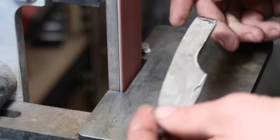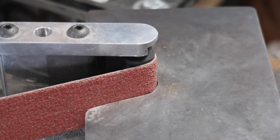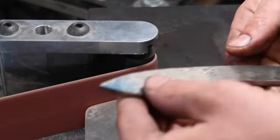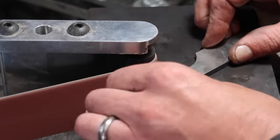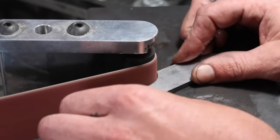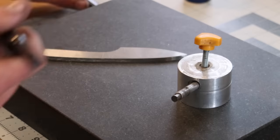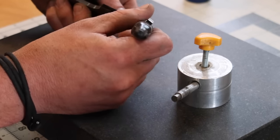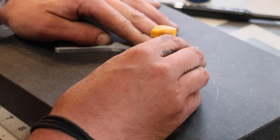This is one of those knives I was like, why on earth hadn't I made this before? Then we'll jump onto my homemade horizontal belt grinder and finish some of the inside radiuses and shaping up that handle, getting it all nice and comfortable. Now we're just going to put a little Sharpie on the edge and mark our center line, our grind line, so that we know we've got a visual reference to grind to.